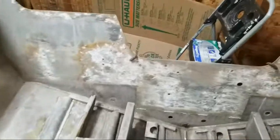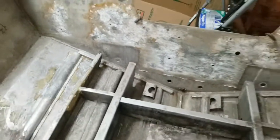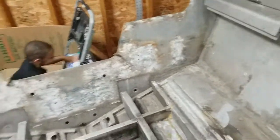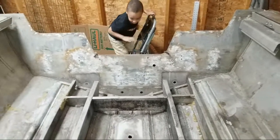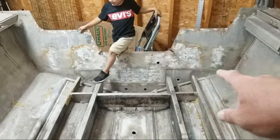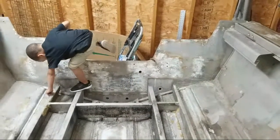The whole transom, a lot of the supports down here were coming off. None of the welds were holding. Basically, it's rated for a 175 for this exact model, and there's no way in heck I would have put a 175 on it, not the way they're built. And you can see they used treated lumber, and it's already taking a toll on the aluminum.